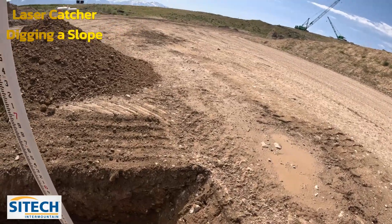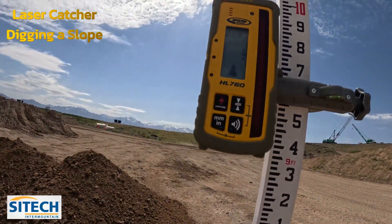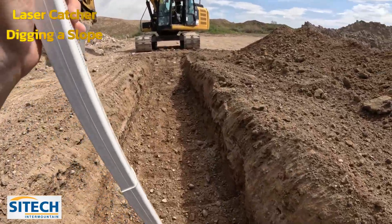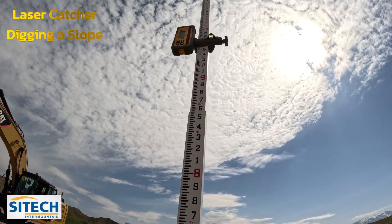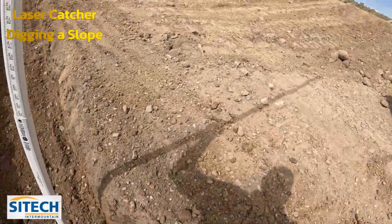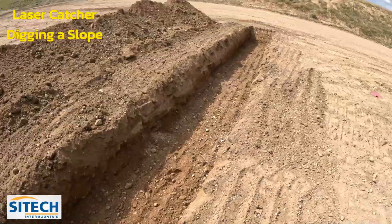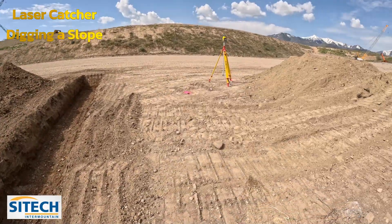I've added 3 feet to the pole. Let's come in to the beginning and set down on the corner right here. Looks like I'm just a hair low — if I raise it up to zero I'm only about a half inch off. Let's check a couple more spots. Same thing, just a hair low. Zero there is just about a tenth above the ground. We'll come down to the very end, set down right there — just a hair low again, same thing — just touching that little window. So laser on a 2%, put the machine inside on a 2%, and that's how you use the laser catcher — as long as you keep referencing every time you move the undercarriage.